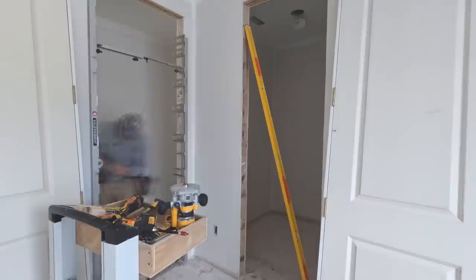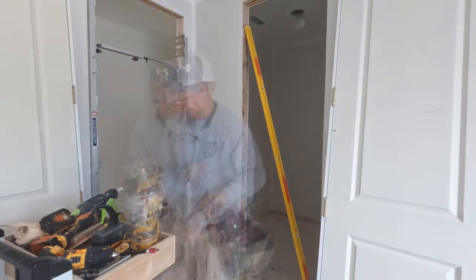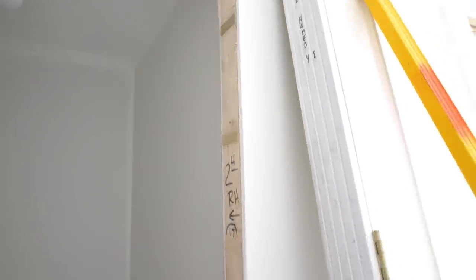Usually when I'm hanging doors with the Jam Master, I prep an entire floor of openings so that they're all pre-shimmed, and then I go through and set all the doors. Here we are, all pre-shimmed. This opening here was pretty straightforward — no big deal. This opening, however, the cripple studs were bowed in. So I bashed those over with the hammer. That's another reason I love the Jam Master: as soon as you put it in the opening you start to get feedback and see what you're going to be dealing with. So I ended up bashing those over and now the door should pop right in there, no problems.